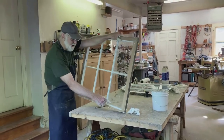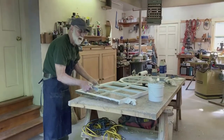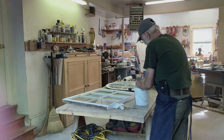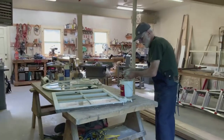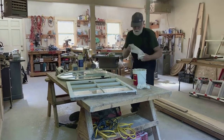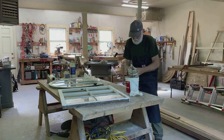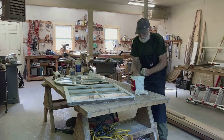You can see in here it makes a nice bed for the glass. There's moisture and everything comes down and condensation, so you have to keep a seal on both sides. It's not just the big putty that shows — the outside putty is chasing the water off the glass, but the inside gets condensation. This putty bit, with a little linseed oil on top of it — if I'm not using a lot of it, it dries out on the top.